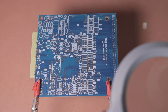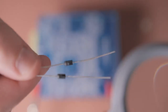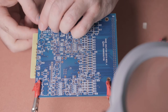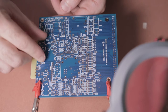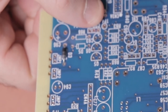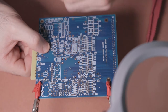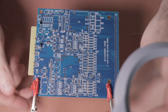Once that's done, you're ready to start populating the motherboard PCB. The first components to solder are the diodes — some zener diodes and a couple of other diodes. With diodes, always remember they are directional, so you have to make sure that the thicker line matches up with the little black or silver line on the zener diodes, and make sure that is correct to the marking on the PCB. If you get this wrong you might end up with a burnt component, so be very careful.